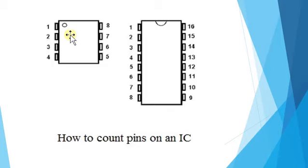In order to identify how to count the number of pins and which direction to number them, ICs are provided with a dot or a notch — some will have both, some will have either one. These notches or dots indicate which pin is the first pin. If the dot is here, the first pin will come on the left side. Similarly, if the notch is in the upward direction, the first pin will be here and you count sequentially downward. Once you know the first pin, the remaining pin numbers increase sequentially as you move counter-clockwise around the chip.